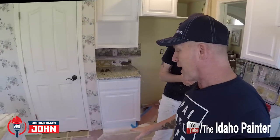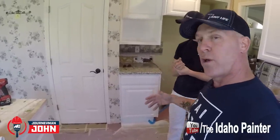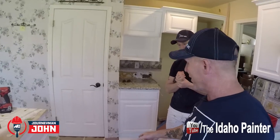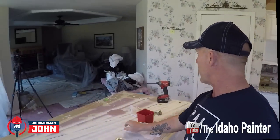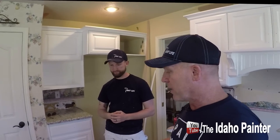We do a lot of masking, and as you can see there's a lot of dust and dirt in here. We're going to roll all this up and mop the floors and clean it. We get questions about what this red paper is — we've got red paper on the countertops, which are new granite countertops. That is rosin paper. It is not completely leak-proof, but it's pretty much leak-proof unless you drop a whole gallon of product and let it soak through. It's more expensive than the brown paper that comes in the same size rolls, because it's more absorbent and stronger.